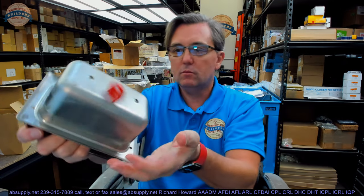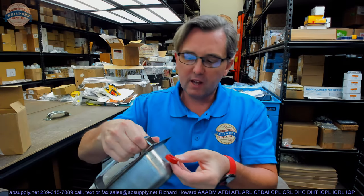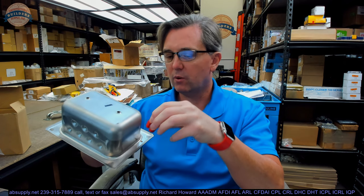By the way, it is made of complete, total stainless steel. There is something slightly magnetic in the back, which could be a screw or rivet used to hold the bar on. Stainless picks up magnetic properties when it has been worked or machined, and it is definitely magnetic in those areas altered by the manufacturing process.